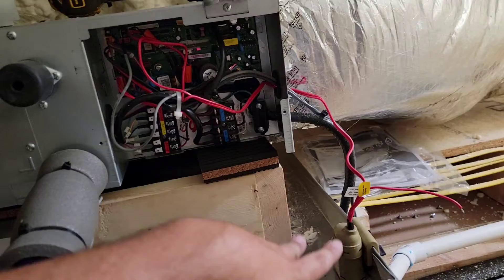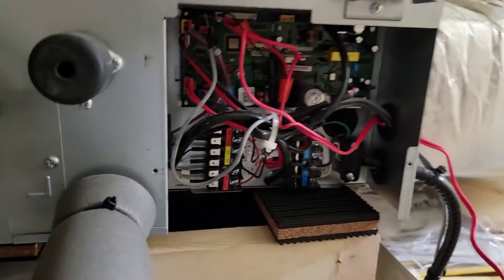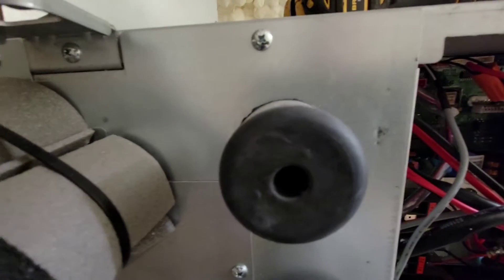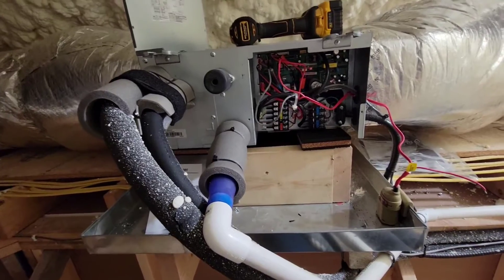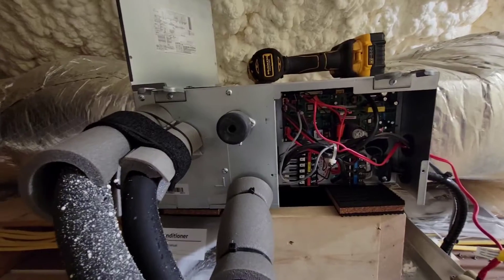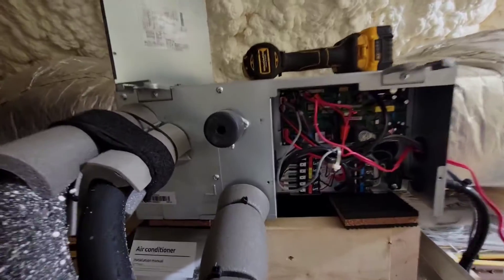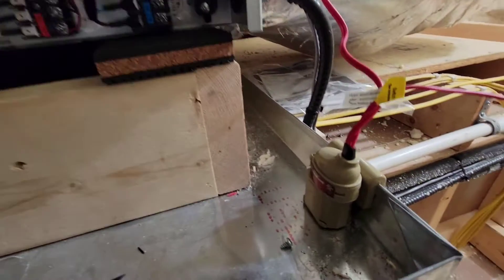So the first thing I'm going to talk to you about is how I installed the float switch, and then after that we're going to talk about a couple installation tips. Now, this is the gravity drain right here — gravity feeds out of the ducted air handler here, and it's on the bottom. The top connection is for the pump. There's a built-in pump, and usually we use that, but in this case we're using the gravity drain. Most cassettes have a pump as well. You may need to do an installation option where you select the drain pump being used, and I'll show you that in a second.